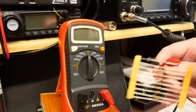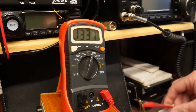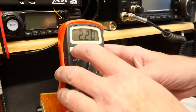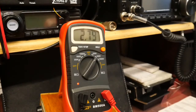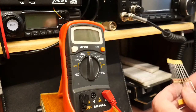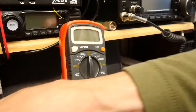I've got the leads hooked up to a 2.2 mega ohm resistor. Going on to the 250 volt range, keeping my fingers well away — yep, that looks pretty much like 2.2 mega ohms, so that's good. Trying that at 500 volts — yep, 2.2 mega ohms again. I'm not going to bother going up to 1000 on that one, expecting a similar result. In terms of actual measuring, yes it appears to be accurate — I've tried those resistors with a couple of other meters and get a similar result.